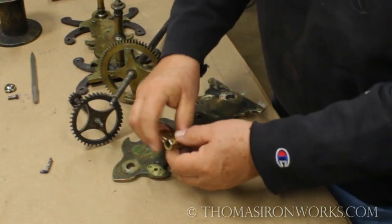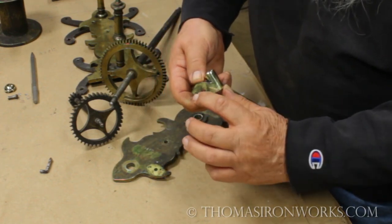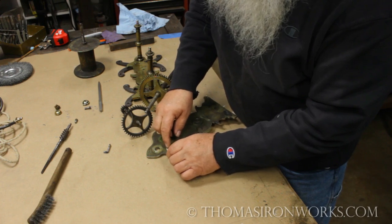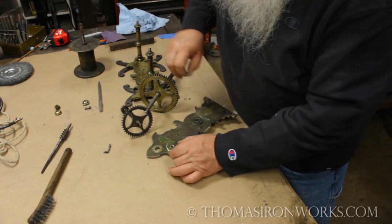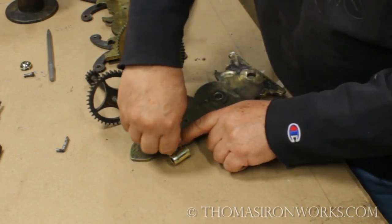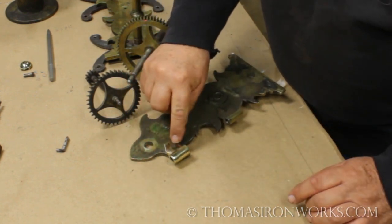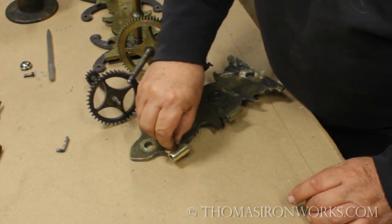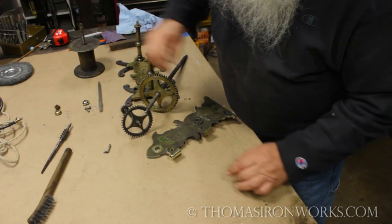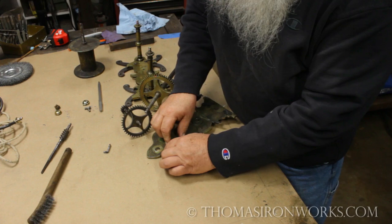See those two dots there? See these two little pins? There are two pins. We do this all the time in iron work. You're going to hold it in here with a screw, right? But the screw would allow that piece to pivot on it if it was just a screw. So these two pins were added to keep it from pivoting. I've done that many times in iron work - a blind rivet is put in to keep the piece from pivoting after it's in there.